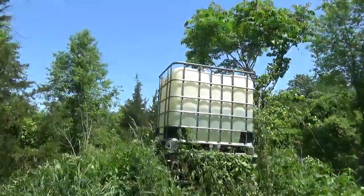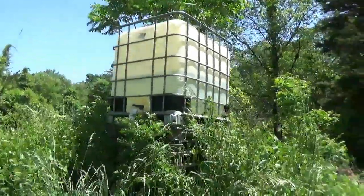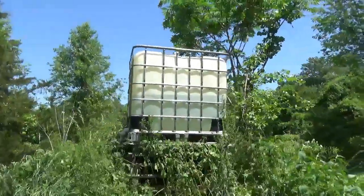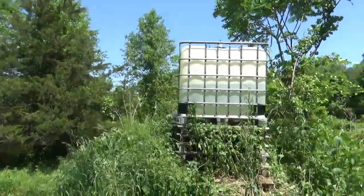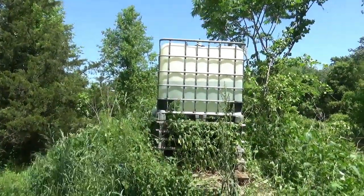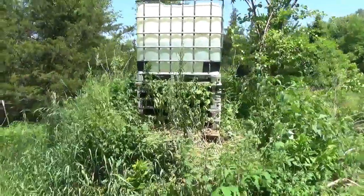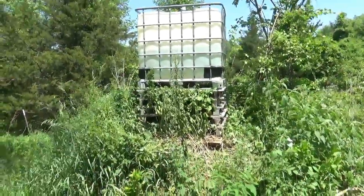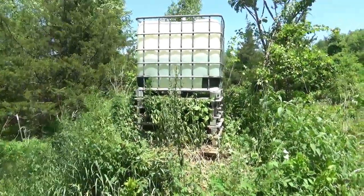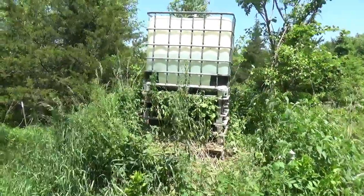So here on the ram pump reservoir, last year I had this pretty well leveled up. This year you can see there's a bit of a lean to the right hand side. That's why that water line is so off kilter in there. So I may end up having to shim it up a bit on this side, which will mean for safety reasons I'll want to drain the tank back down to do that. But we'll shim it up and get it leveled up,